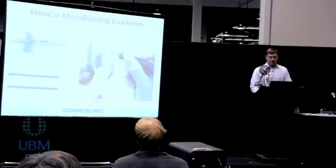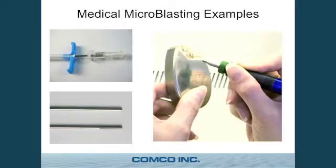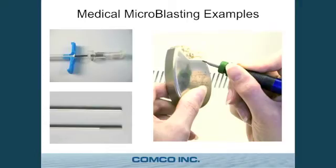Some typical examples in the medical arena: on the left, a customer wants to over-mold a plastic piece onto a stainless steel tube. Stainless steel starts off pretty smooth, so you need to make it mechanically rougher so the plastic has peaks and valleys to flow around and grab onto. In that case, the shape of the features mattered and the height of the features mattered, but maybe not the peak spacing. For the pacemaker on the right, customers use the blast to add a nice even matte finish to the outside, or more interestingly, to remove over-molded plastic from where the header was molded onto the can.